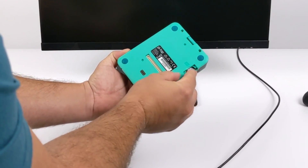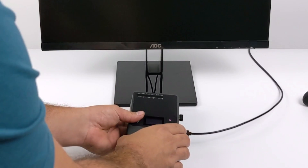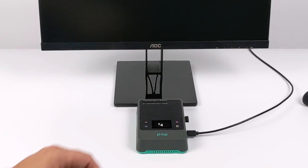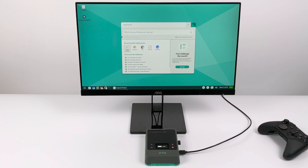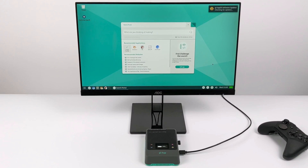Insert the freshly flashed SD card, put the cap back on, plug in the micro HDMI — since there's a built-in battery I don't even need to plug in power. Hold the power switch for about two seconds and it starts booting up; you can see the OLED is working. On initial boot you set up your language, location, Wi-Fi, and Bluetooth. I have a walkthrough video linked in the description. Once setup is done, it boots directly into Pi Top OS, which is based on Debian — so anything you install on Raspberry Pi OS works here. I've already installed Commander Pi, Pi-KIS, and Chromium Media Edition for Netflix.